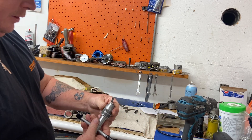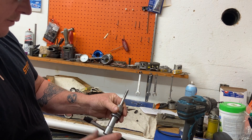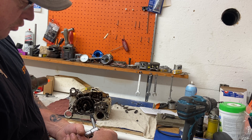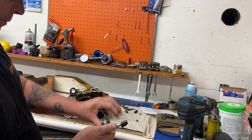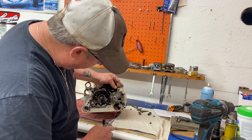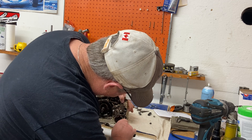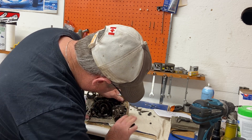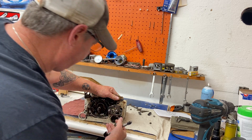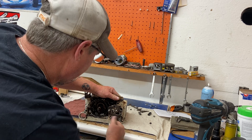Now take your 8x1.25 tap, get it into your tap handle. I've got this old tap handle I love — old good quality ones. This is actually a Craftsman number 4067; my dad and I have had this since I was a little kid. Let's tap the hole now. Go easy with it, keep it nice and straight — you don't want that bolt on an angle. Go back and forth a bit. Slower is better; get a nice thread in there.